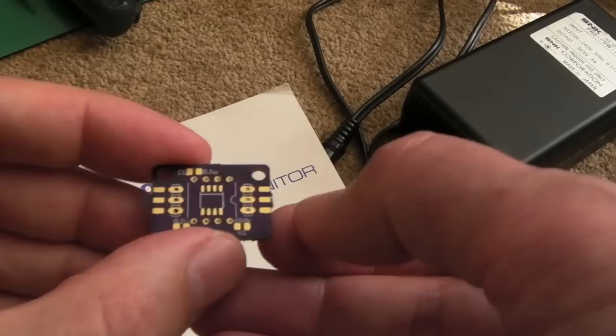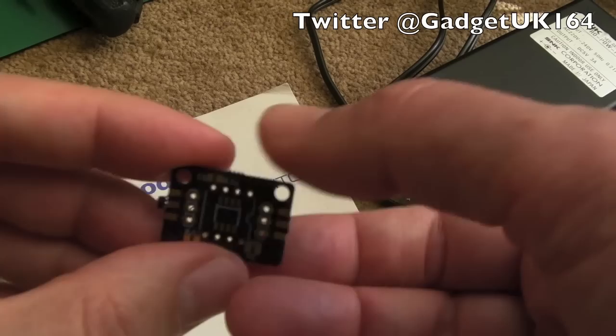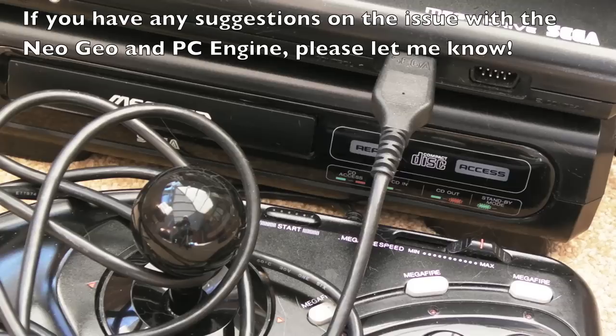The other thing I didn't show is that I also added, inside the monitor this morning, on the connections where my wires went to the pads - just a 100 nanofarad cap and a 4.7 microfarad electrolytic, two of them in parallel over those connections, just so that board has some decoupling. Anyway, hopefully you found that interesting - thanks for watching and I'll see you soon.